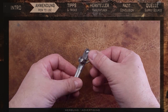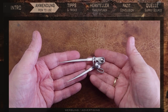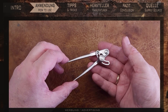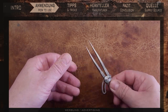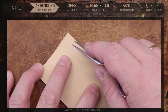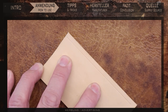What do we need a wing divider for anyway? If you only used them at school, don't worry — this is not about math, at least you don't have to do any calculations. No workbench should be without a wing divider; it's another essential tool. Apart from transferring distances to another workpiece, the most common use is probably to mark out lines. You use the edge of the leather as a guide and draw a line perfectly parallel to the edge of the leather.